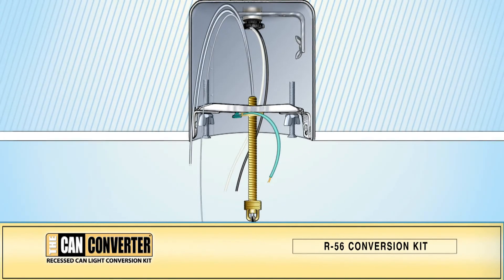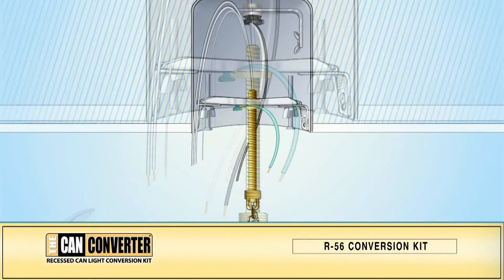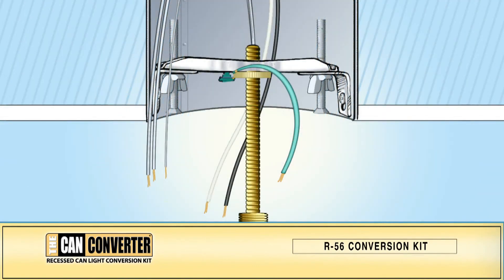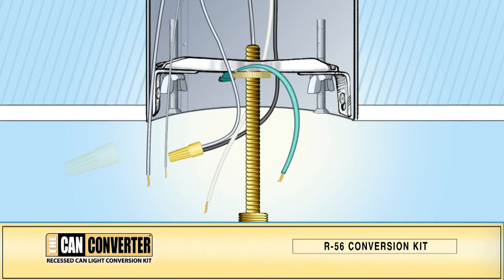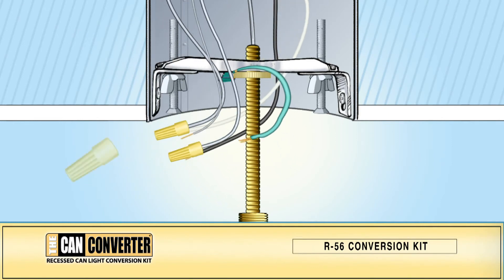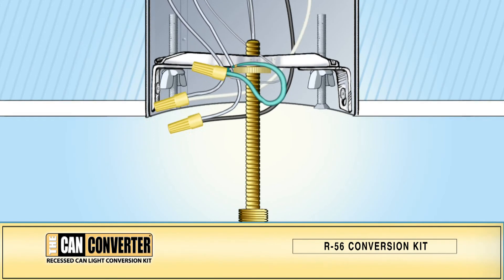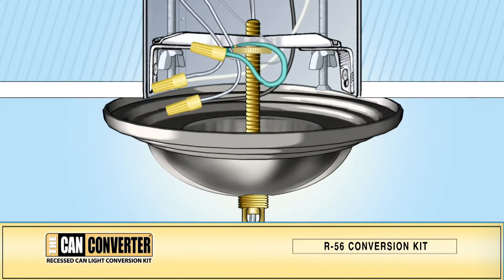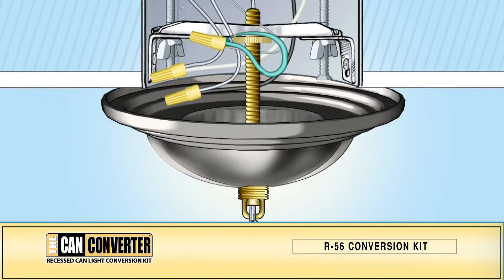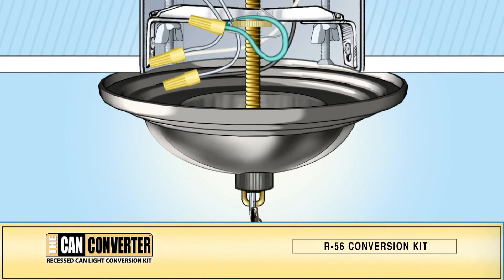Do the same for the hot and neutral wires, then cut off the excess wire. Using wire nuts, pair together the fixture's hot wire and the power outlet adapter's hot wire, the subsequent neutral wires, and ground wires. Neatly tuck the wiring into the can. Slide the medallion and the light canopy past the chain and through the light hook up to the ceiling. Then slide the light hook nut up the chain and attach the assembly to the light hook by tightening the nut.